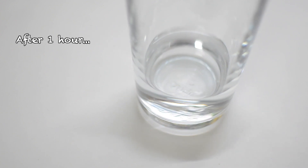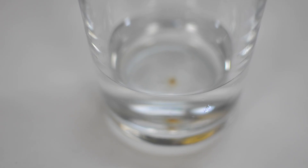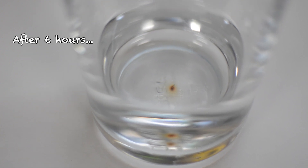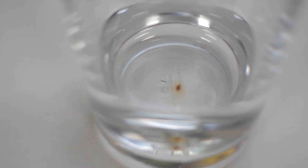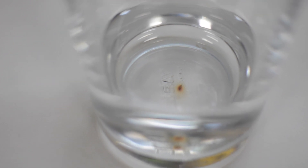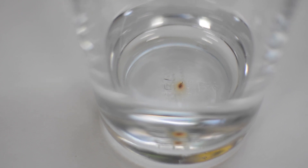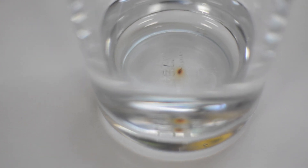After about an hour or so I thought the nickel was going to be good because I didn't see any rust forming, but now it's actually been about six hours. We can see that there is obvious rust forming on that little piece of nickel that I pulled off of the parallel weld. This is without a doubt nickel-plated steel — there's just no way this kind of rust would be forming on pure nickel. It just shows that the manufacturer used a cheaper option by using nickel-plated steel, which means the battery is not capable of supporting the same amount of current as if it was made with pure nickel.